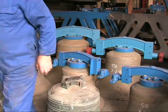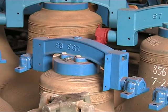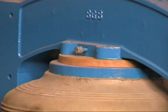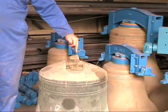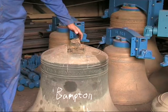That wood coloured. Yeah. Or on the bigger ones like that, where that actually has got wood in it. Depends how thick it's going to be. So that is actually timber. And what timber is that that you've used on that bell? That's Iroko. How do you spell that? Iroko. On these, we should find dead centre and then bore a big hole through again, like I've done with that one, and then we'll slice that lump off.